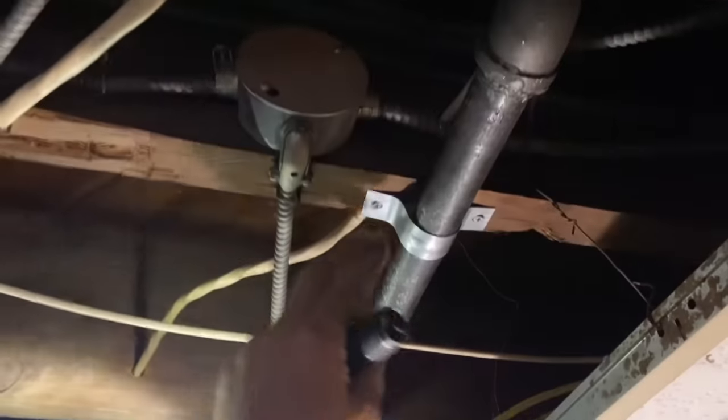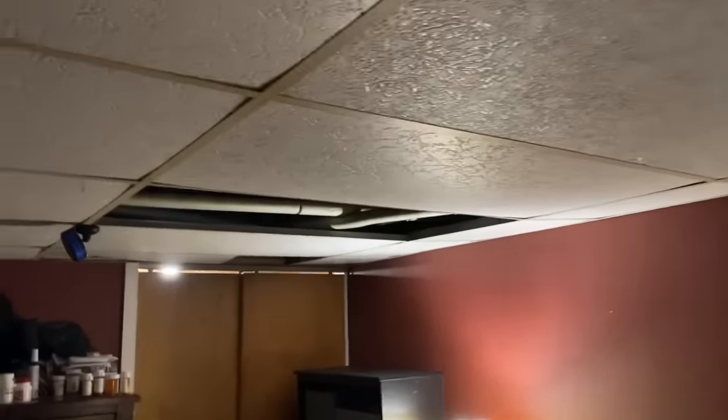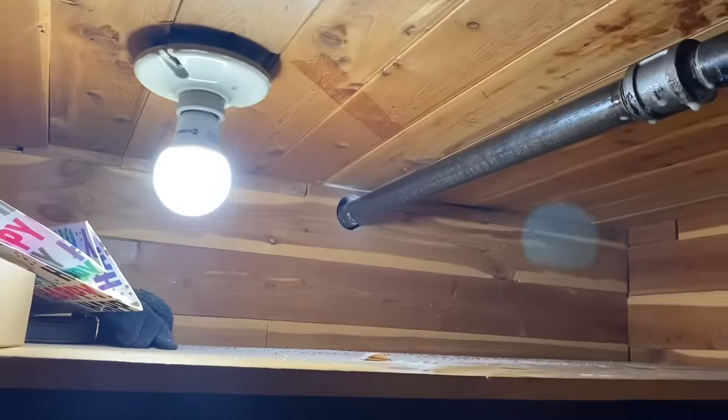Peter's cleaning up a little bit. I'm going to put these panels back on. We have some 1-inch pipe straps every 5 feet along the way, even though code specifies it needs to be 10 feet. These are 10-foot lengths, but we're good. I think we did a really nice job here. Let me show you the penetration through. There's the closet hole, and then we went up into the closet and through there. Very nice job. Don't you agree, Mike? I'm going to keep it real because this is uncut, unedited, raw.